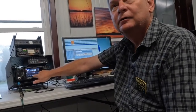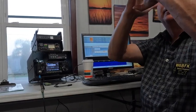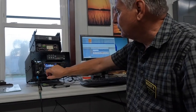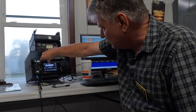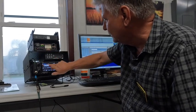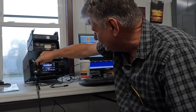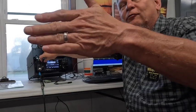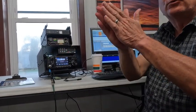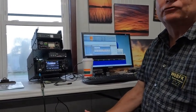Do you keep it centered on everything, or do you tend to adjust it for lower or upper sideband? I basically pinch it in, but sometimes — especially if we have an adjacent signal we want to attenuate out — we can just shift. Let's say I have somebody that's below me and I'm trying to work a signal right next to them. I can attenuate that signal out and basically hear what's right next to it but not the interfering signal. So you can shift to upper or lower. That's probably one of the biggest tools we have to control the noise making it to our ears.